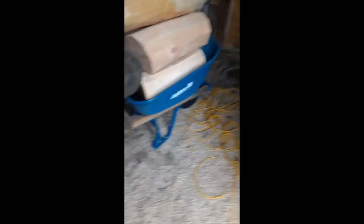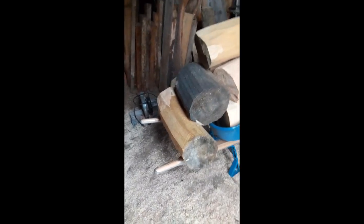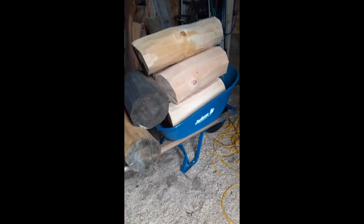Here's a nice pile. It's important to store your stuff undercover or inside. You can have it like here under an old barn roof — somewhere where the rain and sun doesn't get to it a whole lot. A rained-on, sun-beaten piece is still good on the inside but it's going to be a little harder; that's called hard casing. I like to get them in a stack outside, covered with sheet metal or plywood, up off the ground. But right now everything's moving so quick in the shop that I'm just throwing them in the empty bay.